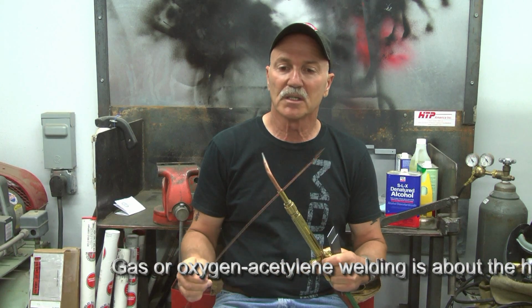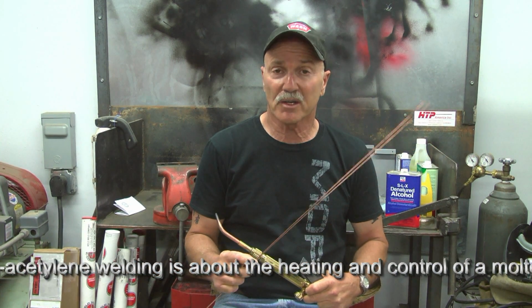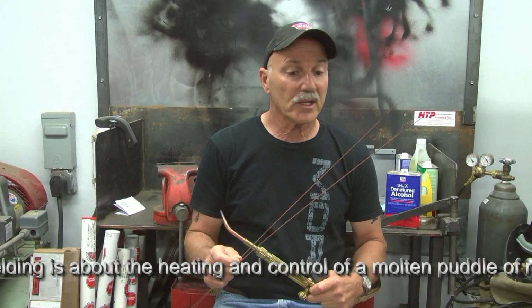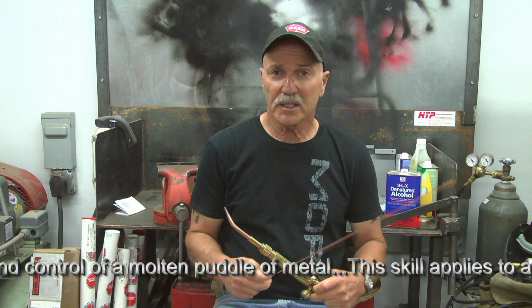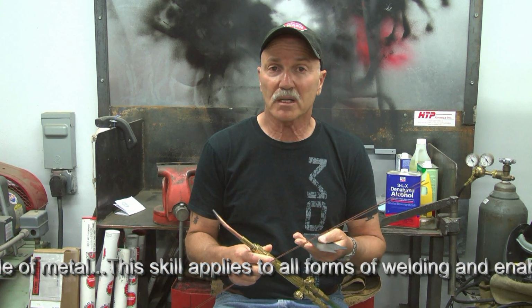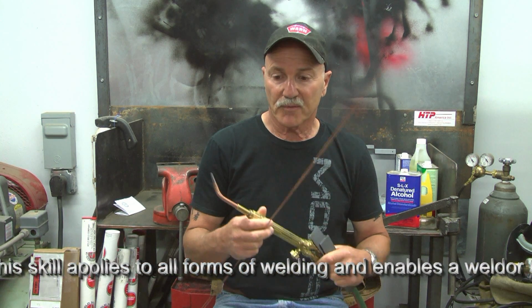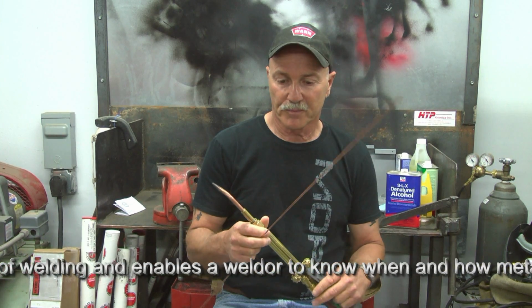In this session we'll start welding. We're going to use this 16 gauge coupon plate, sheet metal if you will. Our filler rod in this case for our very first project will be ER70S2. It's a fairly high tensile, a 70,000 tensile filler rod that has good properties for working with clean metal in particular. And of course we have our torch set up with a number 2 tip.